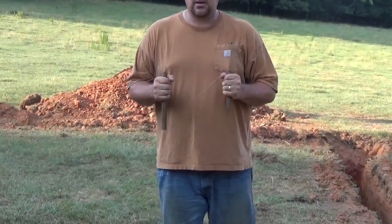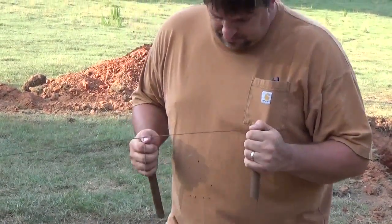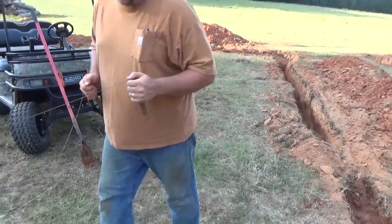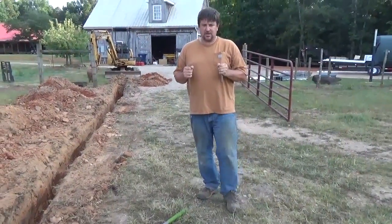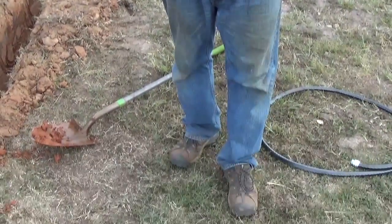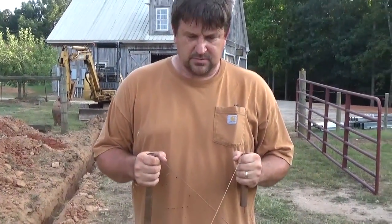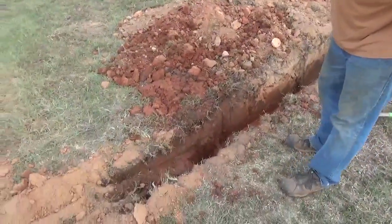I highly recommend coming at it from a couple of different angles — it starts to make an X. Just make a mark in the ground, then come at it from a different angle in that area in question. Walk slow — and see how it starts diving? I did not do that; it's wanting to make that X, and it's making it pretty hard. That's right above the mark I was making, and it lines up with my pipe.